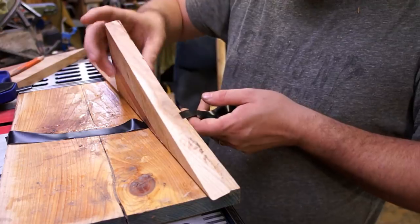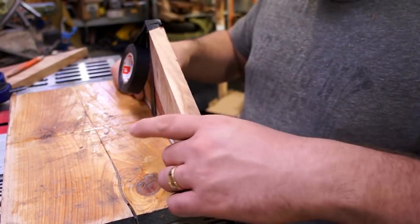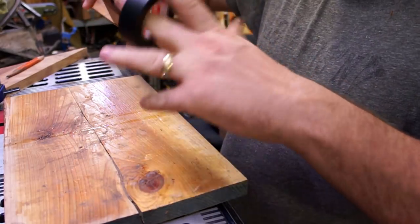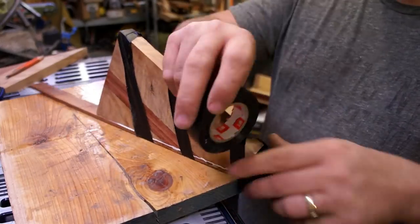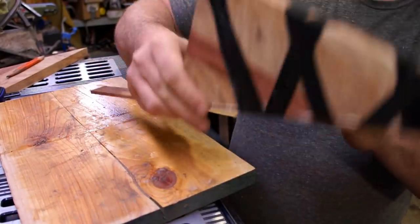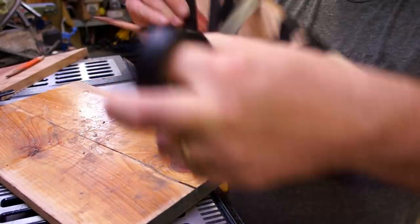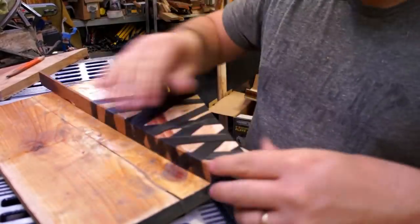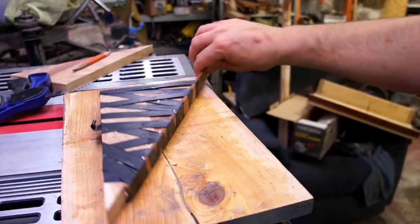A good trick if you can't get a clamp to work on regular surfaces is to just use a bunch of electrical tape. Turns out this is a really good way to use up crap electrical tape that's not very sticky, because it doesn't have to be to clamp wood — there's a lot of stretch to it still. If you wrap it tight around there you can get a lot of clamping force out of it. Just don't wrap too many times; you want to make sure there's airflow so it'll dry, but other than that it works like a charm.